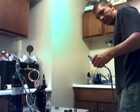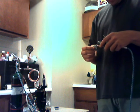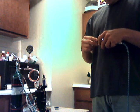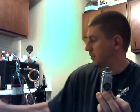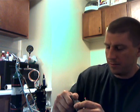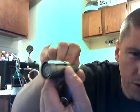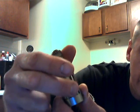I'm also doing some testing on this little air tool that I intend to one day hook up to an inertia propulsion device I've been working on. I don't have the tools to build it, but I think I may know some people who do now. Anyway, I couldn't get this apart - I've always wanted to see the inside of one of these. Basically it's no different than one of these others. I have a video showing what's inside - it's just a vane-type air motor. There are little plastic vanes in there with a kind of eccentric lobe - a fatter piece and a shorter piece.